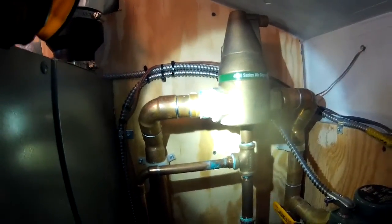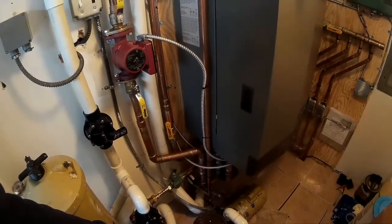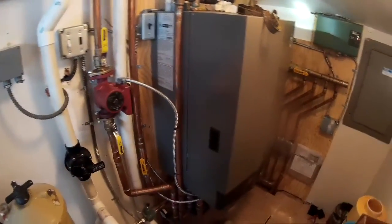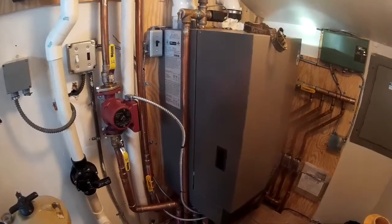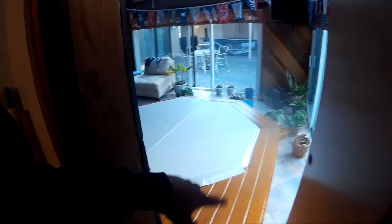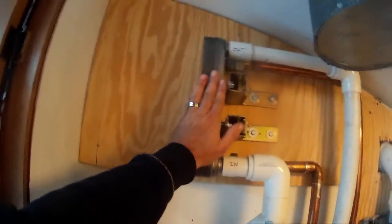Right there it's leaking. Originally there were two boilers sitting in this room — the room is about six by four foot. They originally had one boiler sitting back there and another boiler here for the spa. By code I couldn't put two boilers back in here; it's virtually impossible. So the solution I came up with was a brazed plate heat exchanger.